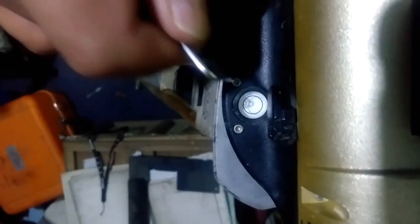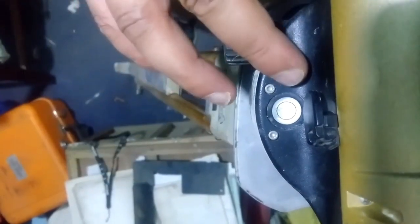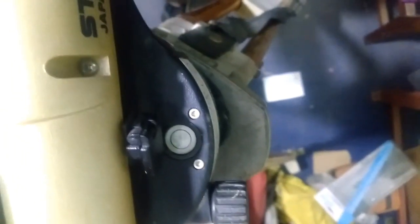We have seen the rotation direction that moves the bubble. Since my bubble is outwards, I'll rotate the key counterclockwise. Now my bubble has come a little inwards from outside. Again I'll rotate this device to the other side — my bubble is out. I'll adjust with the foot screw and bring it to center, then rotate the device to 180 degrees again.